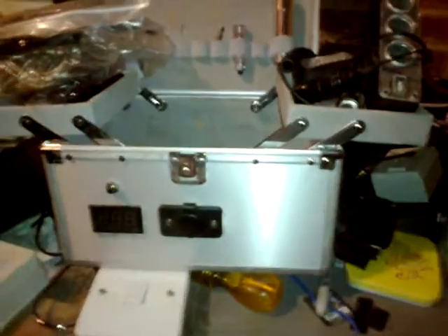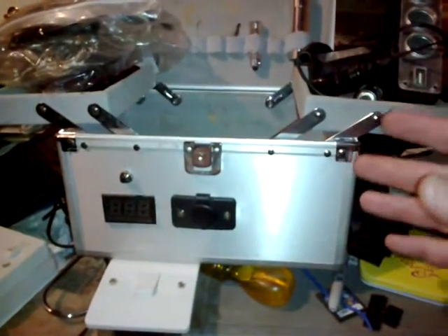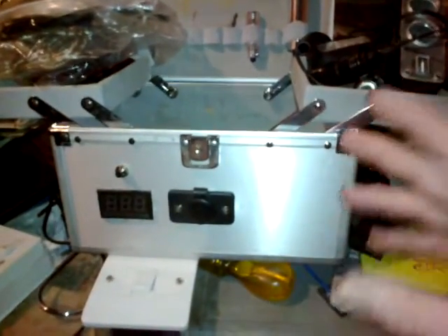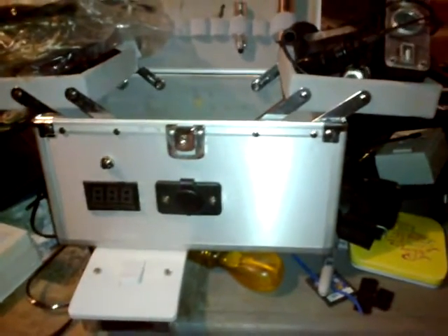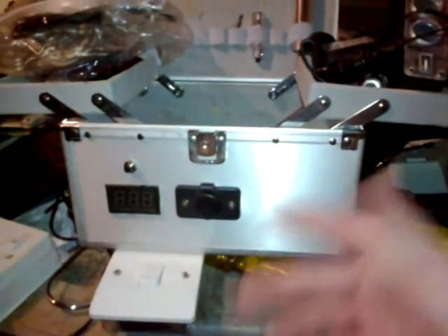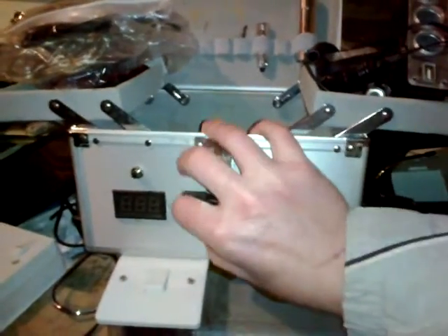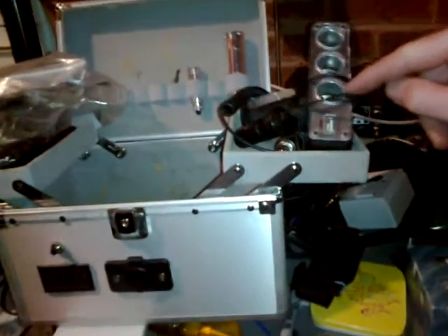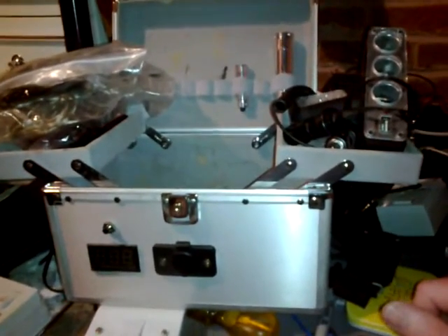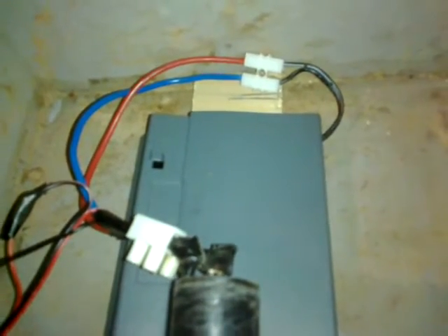So that's the update for the little solar box. This is just for camping with the wife and kids — we can charge our phones off there, run the lights in and out of the tent. Also useful for wild camping, doing a lot of recording, or to power CBs. If I'm on a net or want to take a radio out, I can run a 12 watt radio straight off that. I probably wouldn't run the linear — I reckon the big battery lasts about 4 hours — so I wouldn't run high power like the 10 amp I've got. I'd just be happy with 4 watts on the radio.